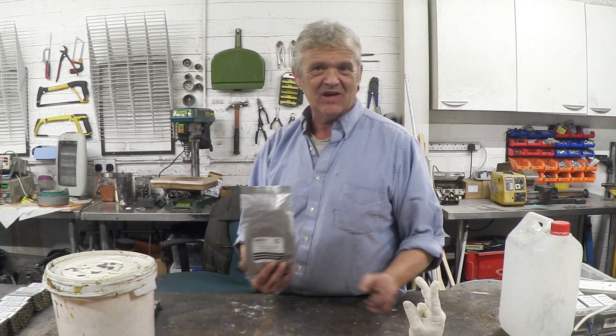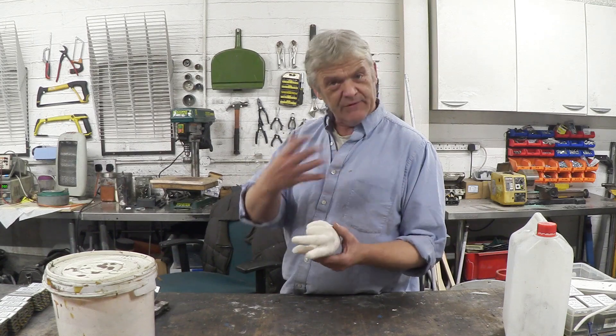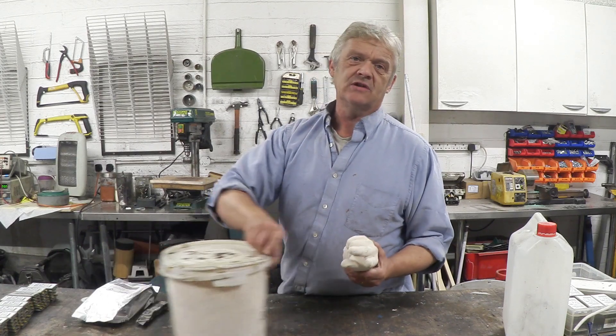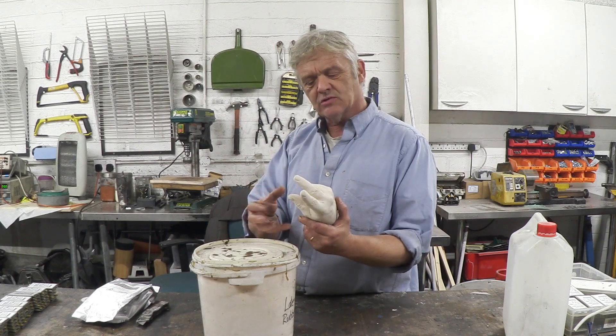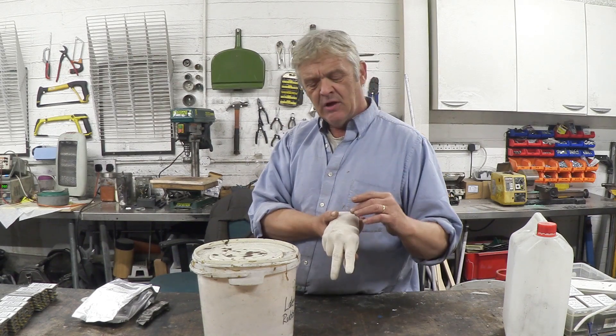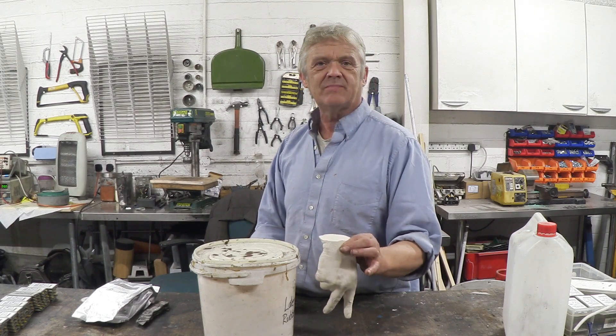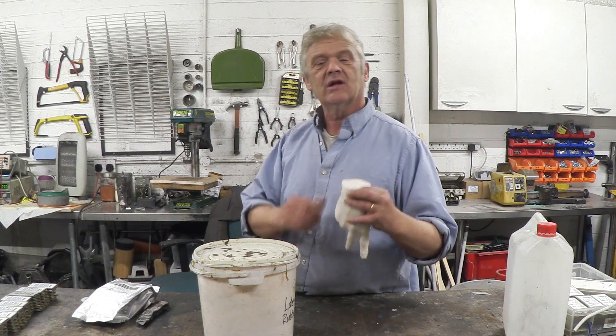If you didn't watch video 1277 to see how that was cast, go back and have a look because it really is easy. What we're going to do now is make some gloves. The beauty of plaster of Paris is that when you've left it to dry and dip it in latex, the moisture in the latex gets sucked into the plaster of Paris and leaves a layer of latex on the outside. The thickness of that layer relates directly to how long you leave it dipped. If you leave it for a day or so you get a really thick, chunky layer that makes a mold you can use a couple hundred times. For a glove we just need to dip it for a minute or so, hold it, pull it out, and it'll get its layer of latex.